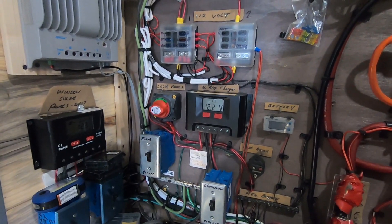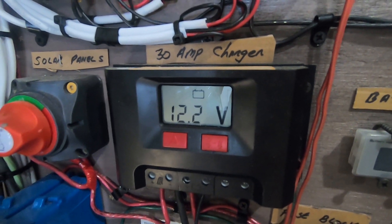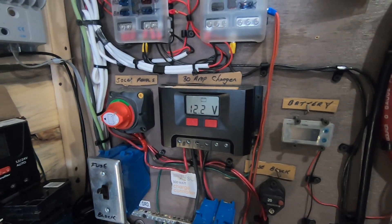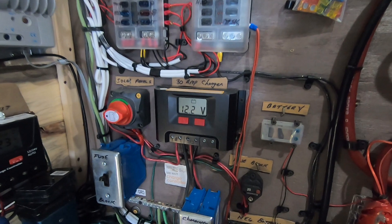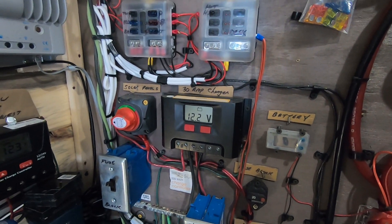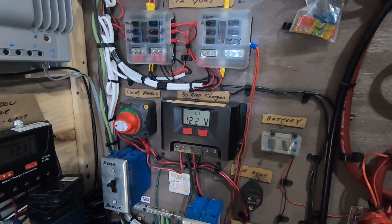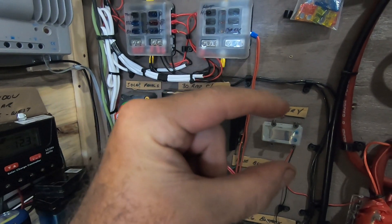I was going to show you a little upgrade I'm doing to the system here. I've got a PWM charge controller and it's showing a little low voltage because I've got everything on so the camera can see it. I'm going to turn the switch on — I'm overdriving this charger. You'll see the voltage jump all over the place. This controller is charging my battery bank and I could live with it, but being anal retentive as I am, I don't like the voltage jumping around. This charger is cheaper and it can't keep up — it keeps clipping the voltage, shutting it off and on.